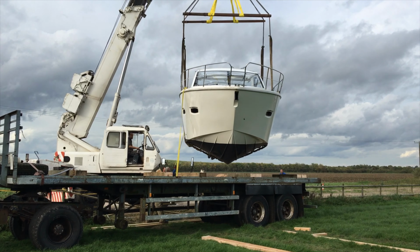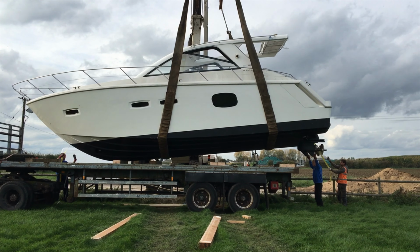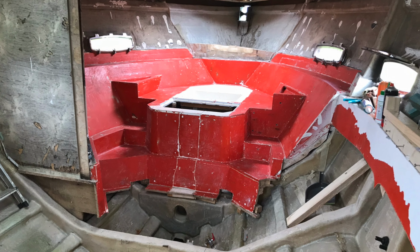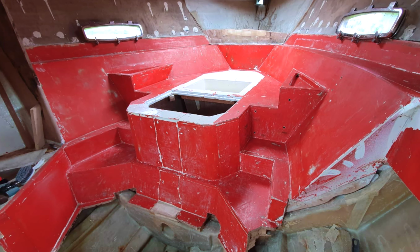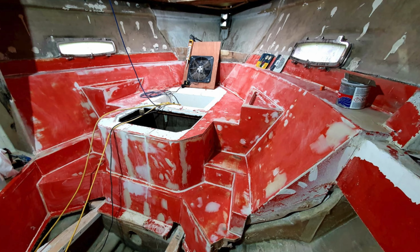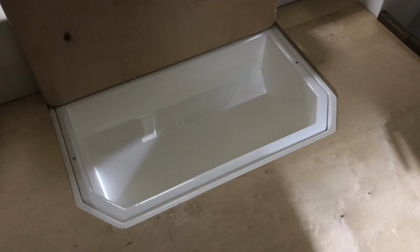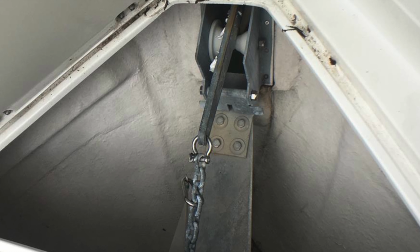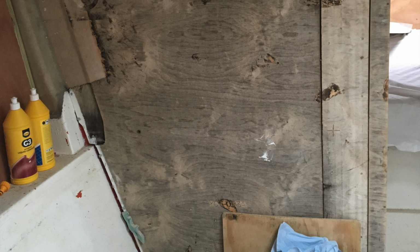We acquired the boat in late 2017 and intend to fully rebuild the boat by producing new fibreglass parts using the original plug installed. The next stage of the rebuild is to refinish the master cabin bed plug, which could then be used to make a fibreglass mould. This new mould would then be used to produce new fibreglass bed parts, which could be bonded and glassed into place. Once the bed was installed, we could also install a new fibreglass chain locker, fit a new chain locker bulkhead, and install new bulkheads in the master cabin to help add strength, which would be identical to the production boat.